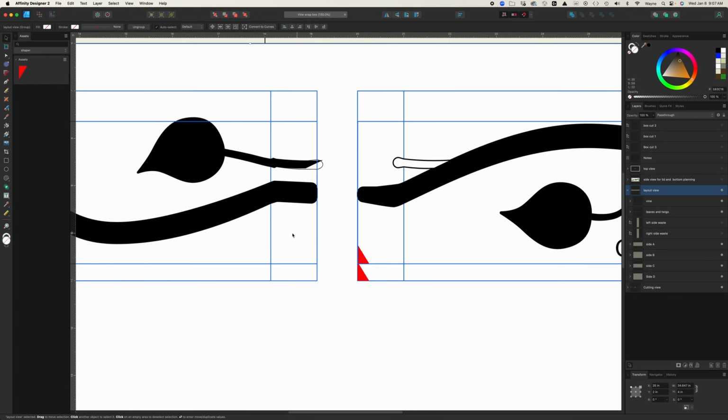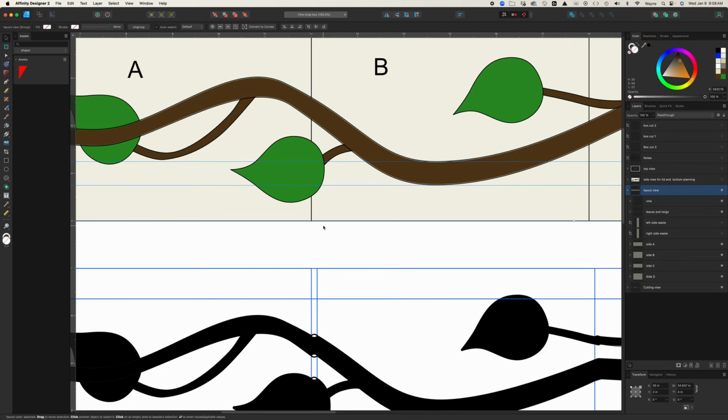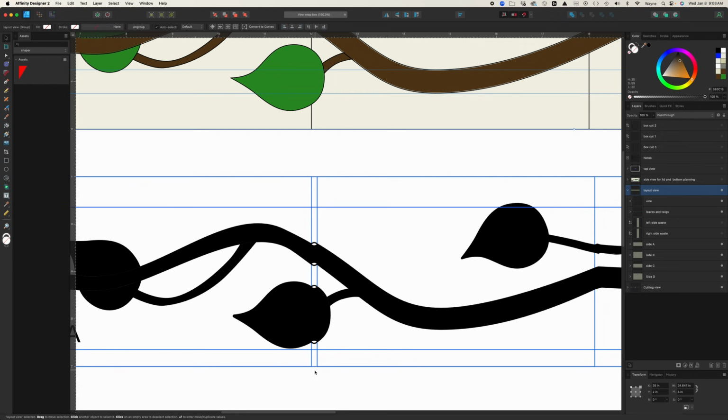If you look at where a saw blade kerf is going to hit, I've actually added some extra room to the inlay itself, knowing that I have to go and cut that thing apart, and that's going to end up just being sawdust. So that's basically how you do it. There's a lot more detail. I realize I'm not giving you enough here that you could have any chance of following along with this.